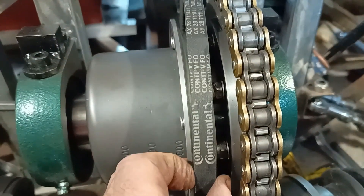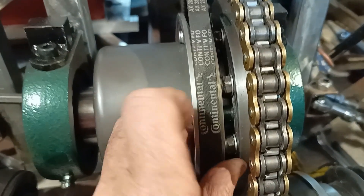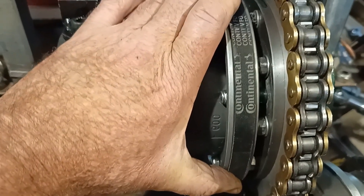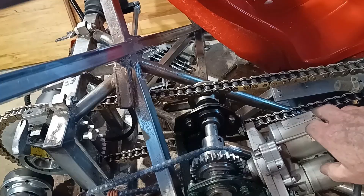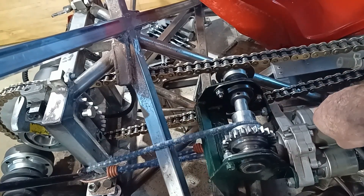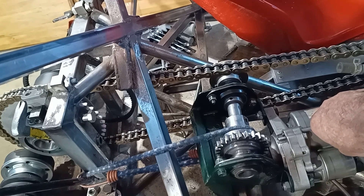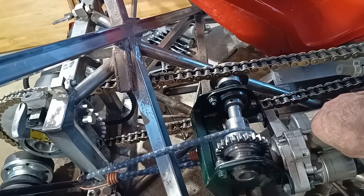The belt hangs loose when the vehicle's running forwards. When I pull up the tension at the other end, the belt will slip in and engage with both pulleys — the drive pulley and the driven pulley. The pulley sits slack, and when I engage the unit by pushing it down, it'll tighten the pulley onto the diff and then engage a micro switch to run the motor and give me a reverse gear.